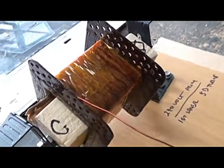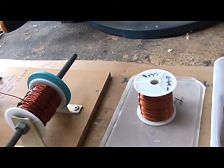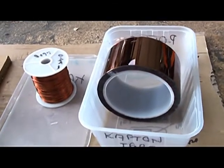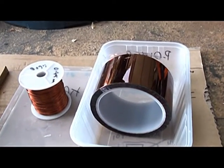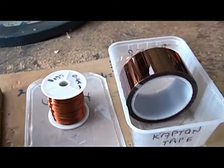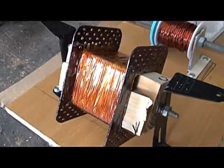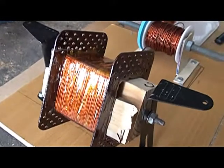The insulation that you can see over the wire is actually Kapton tape — a tape material used by the PCB manufacturing industry for solder masking. This is a 50mm roll, costs $9. Its properties include an insulation of around 6,000 volts and a temperature rating greater than 300 degrees centigrade. The normal specification for transformer insulating tape is around 130 degrees — if the transformer reaches those temperatures it's probably not much good — but this tape exceeds that. Normal tape is around 3 to 5 kV; the insulation on the enameled wire is extra high voltage, probably several thousand volts, and also high temperature.